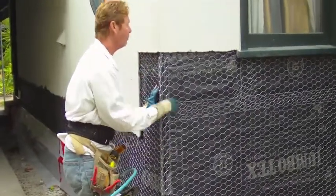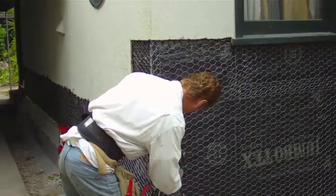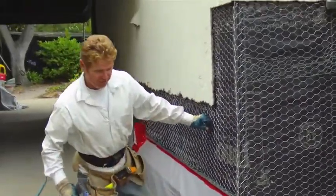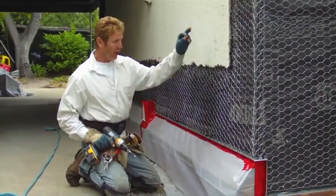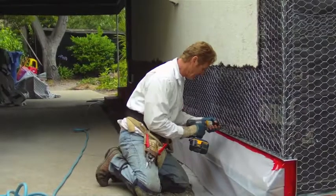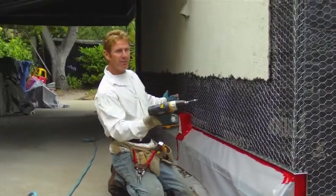We want to put our corner here — it's going to line perfectly with the top and perfectly down here. Now, because there's double metal flashings here — we've got the copper and the steel — I'm using screws. I have some custom screws with washers on them, using a hexagon bit, and I just screw them in. The big washers grab the wire so I'm not missing. I'm also putting a couple of screws to hold the bottom of that corner.